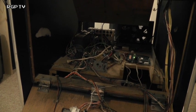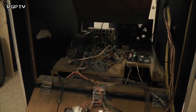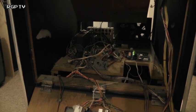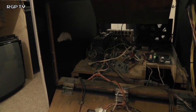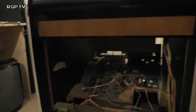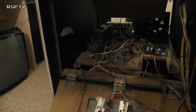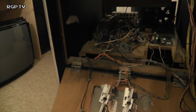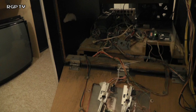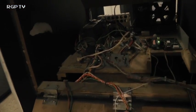It seems a shame given the state of the wiring - it's definitely going to get a complete rewire. I'm probably going to swap out the PSU as well. It looks like it's probably solid, but as I'm going to put a game board on it that I absolutely love I'm going to give it a brand new switching PSU. The linear ones in a lot of these machines are great, but you know they're going to overheat - there's a big cap in there that's going to pop at some point. They're easy to rebuild, sure, but if the voltage regulation goes all over the place it can shove eight or nine volts through your board.